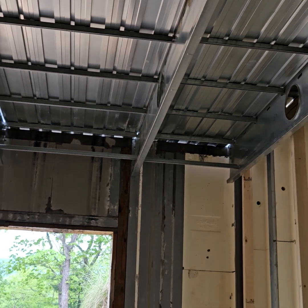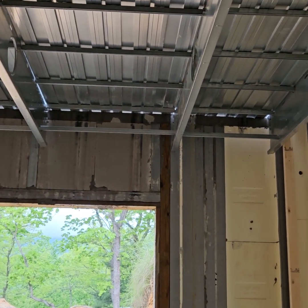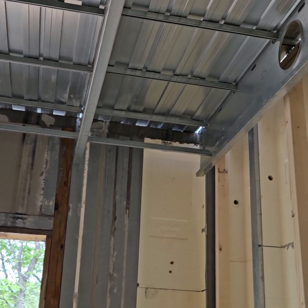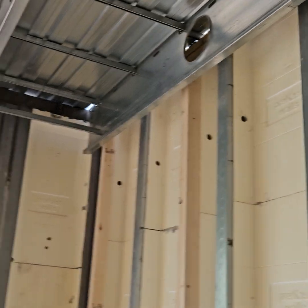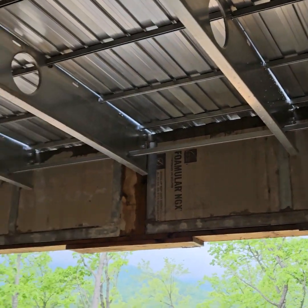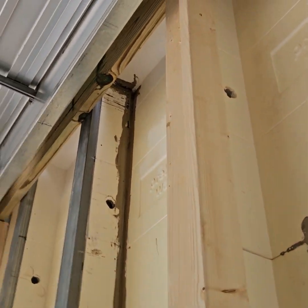So if you're using a Superfloor, or not a Superfloor, if you're using a Superior Wall, pre-cast concrete walls, in Western North Carolina, it's Superior Wall or K-Wall. We actually used K-Wall. Have the 4-inch by 4-inch lip placed all the way around the exterior of the home, not just on the bearing ends of the beams. And you'll negate the need to do this.